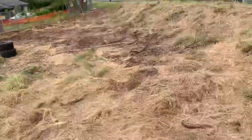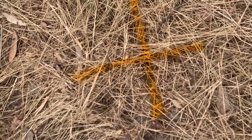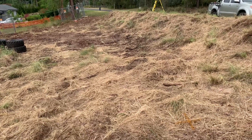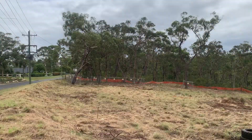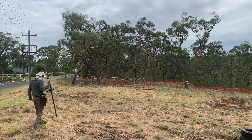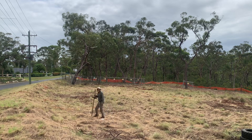Initially what I like to do is quickly stake out the corner and put an X mark on the spot on the ground — that's the quickest way. Once I know where that is, I can decide what sort of offset mark I'm going to use. In this case, I think just a couple of metres to the corner of this retaining wall. Now we're going to go put some pegs in the ground. This will be a 2-metre offset.